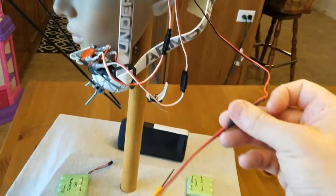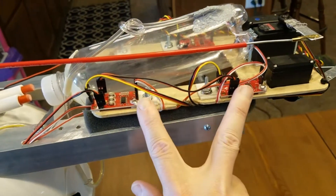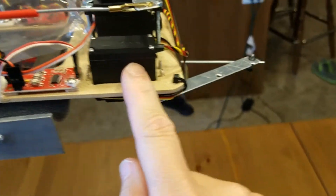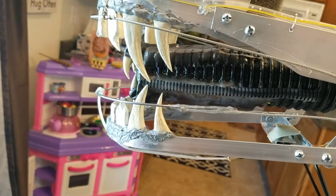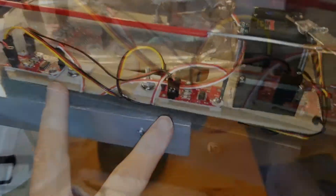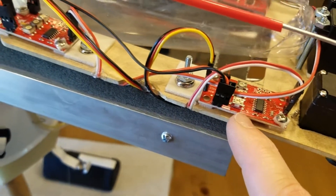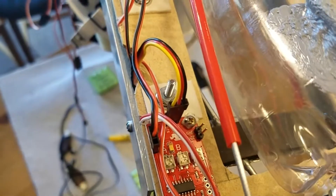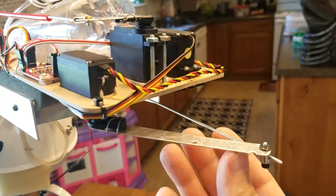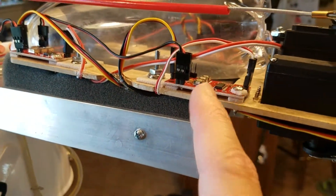This is the power right here that goes to the batteries. The switch comes up here, I split the wires and they both go into these two boards that control the lips from this servo here and this servo here. This one is a high torque servo that controls the movement of the mouth in and out. The wiring wasn't too hard. I have one battery pack and it's jumpered from here to here to provide power to the two servos. These circuit boards are SparkFun servo trigger boards — I bought them off Amazon, but if you go to the website you can find them a little bit cheaper. They work very, very well. There are three settings on them — it controls point A, point B, and then the time, and all you have to do is rotate it a little bit. It only moves about 120 degrees; you're not going to get a full 180 degrees with these servo boards. You can reprogram them — I decided not to.